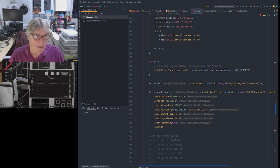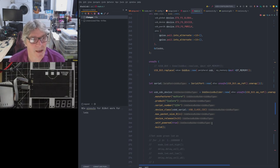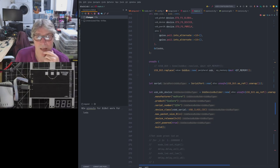So we know it's powering up. We measured the voltages last week. We also measured the voltages on the FPGA board, as well as the 5-volt, 3.3-volt. We had the 1.2 volt working, so it should all be hunky-dory. Because we've already used the BitBang soft SPI code to program the ICE FPGA, assuming that all the connections are in place and everything's connected correctly, we should be able to program it in a normal manner now. And I did a quick test, and that does work. So let's do that first.